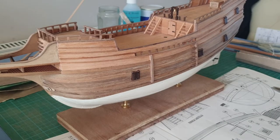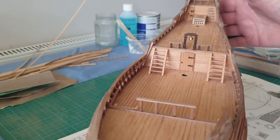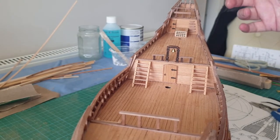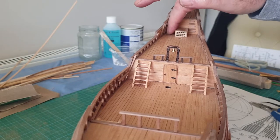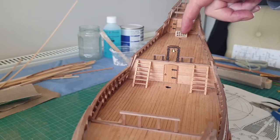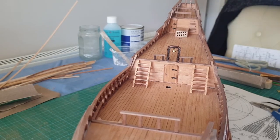Right, we've moved on — got the helmsman's binnacle done, which is back there. I didn't need to show you assembling all that — showed you what it was, glued it all together, sanded all the edges off, and just stuck it into place. One thing I would have done if I do it again is when I laminate the sides, I would have actually put the sides on the back of the grid and then laminated overlapping the side, so you didn't see the edge of the plywood. But it's minor detail.